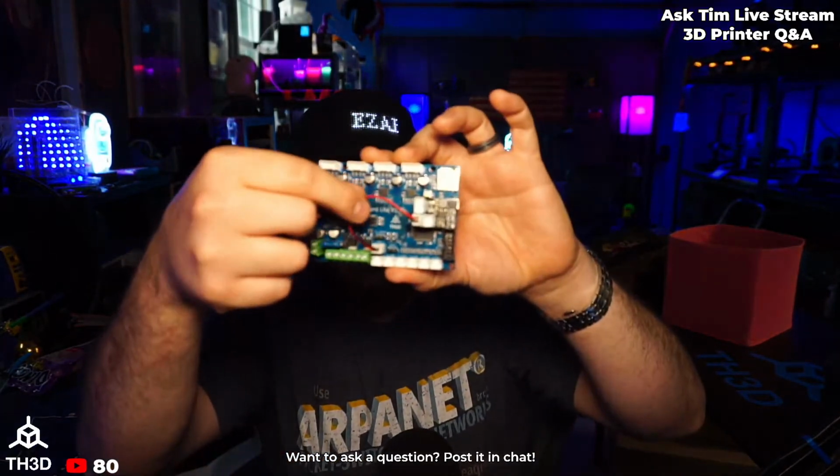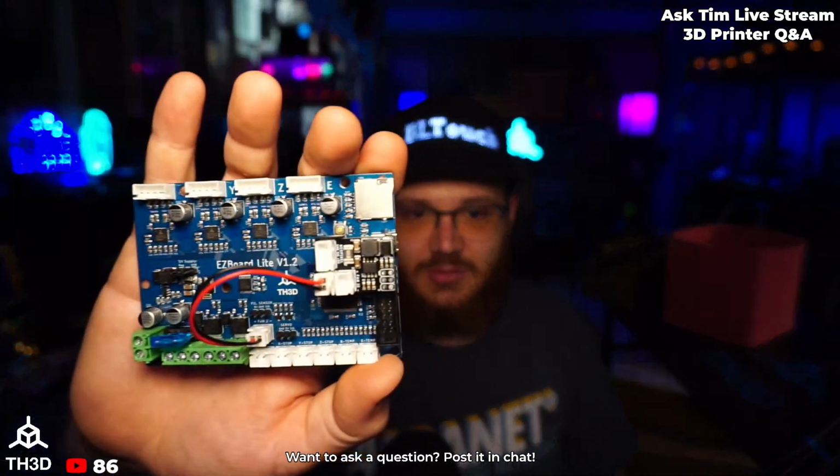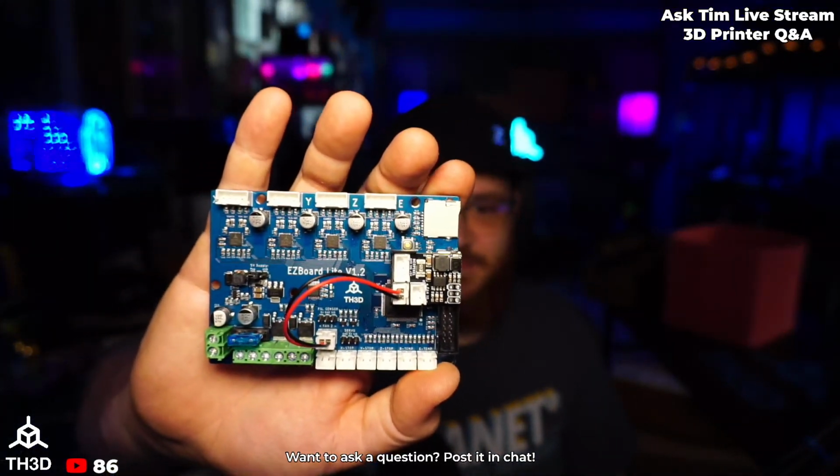We're waiting on these little cables here. I actually had to make my own so I could get the documentation done and the product page done, but we're waiting on this little 2-pin JST jumper, and then we'll have those ready. So it'll be a nice clean installation, and you just plug it in and update the firmware, and the pixels will work. There's actually a whole 5-volt step down on here.